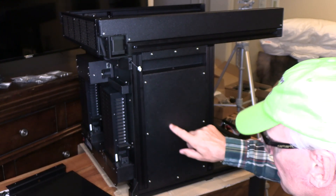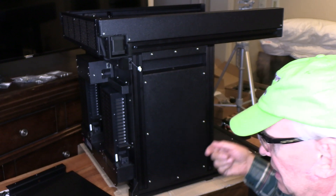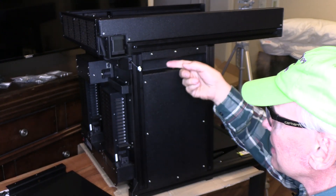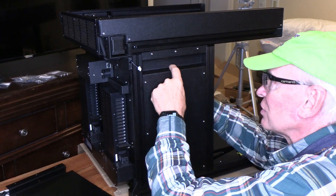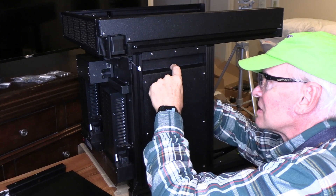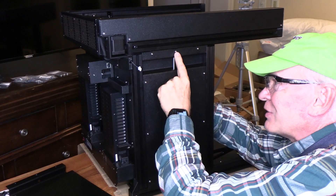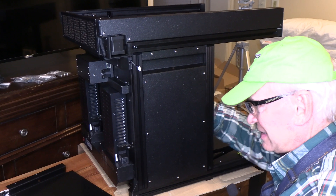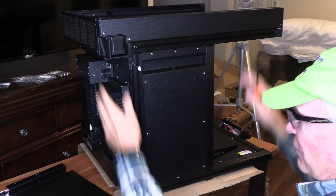Here's the first panel. For the earthing connectors, once you get the screw in from the inside, you need to tighten it into that slot. It's a bit obstructed, but Prusa cleverly includes two holes that allow the screwdriver to go through and tighten that earthing connection. This torque screwdriver that comes with the Prusa works nicely here.